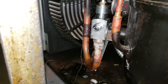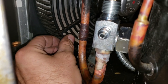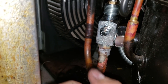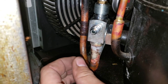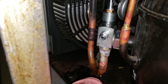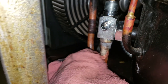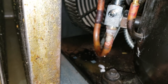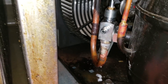Whenever you're welding on these service valves, you always want to mid-seat the stem because they'll get stuck if you go one way or the other, and then you'll have to change the whole valve. Always put it in the mid-seat. My valve's welded in - it was tight, I did it with minimal burning. One big important thing: you have to learn how not to react when you're brazing, because when you panic - you bring the torch across your fingers, drop the torch, catch your pants on fire - that's when you really get hurt. Life happens. You rub up against a discharge line and freak out - you have to learn how not to react.